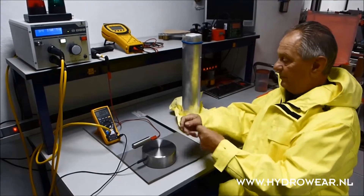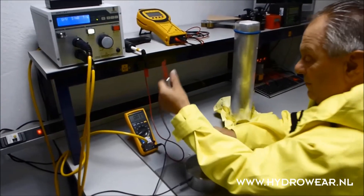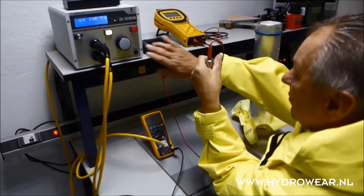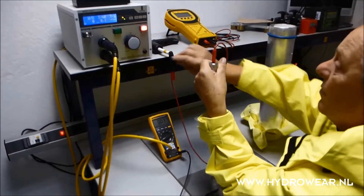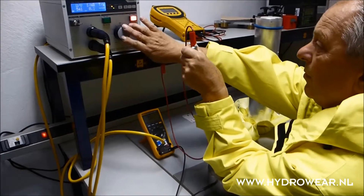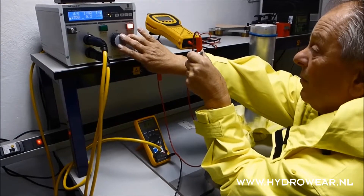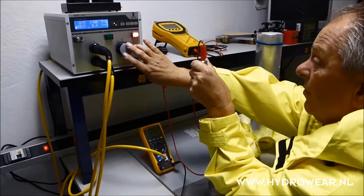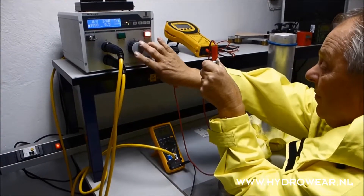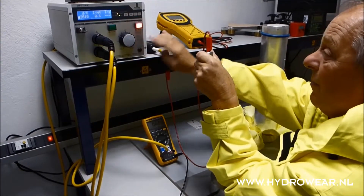The earthing is also a measurement for the leakage — the current leakage which may not exceed 0.2 mA. Now we show the voltage rising up to 2000 volts. At this moment we reach 2000 volts with the full electricity in hands.